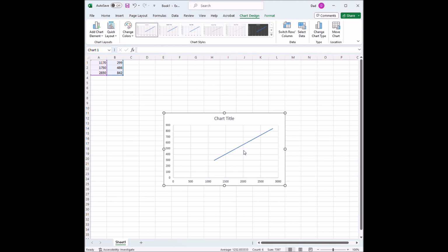I don't know if it is actually reading the right number for this altitude. Then my meter with no altitude correction is also spot on. So that's just a little, do we really need to correct that altitude or not? But I'm just saying that this blower is performing very close to factory specs. It really should have been more up in the 600 range, but it's not spinning that fast. So I think it's an overall success.